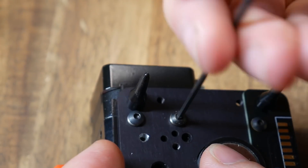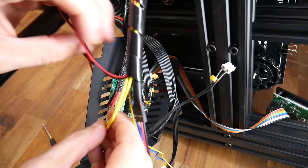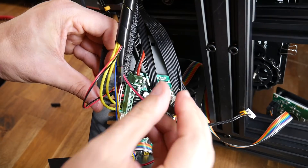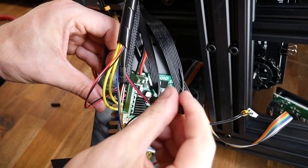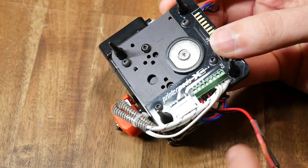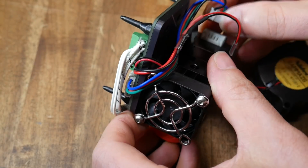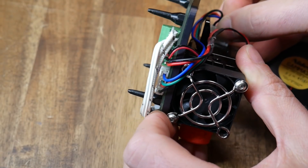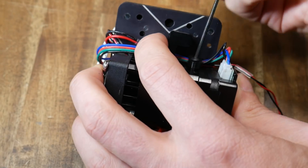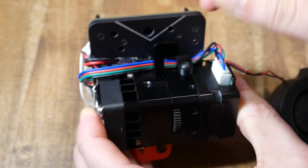Two short M3 bolts and the H2 will be securely attached to the tool plate. For wiring, in a standard installation you'd run all the wires from the kit back to the main board. With the XChange however, I only need to run wiring to the terminals on the back of the tool plate — this includes the heater, thermistor, and fans, as well as a small cable to connect the stepper motor. To help tidy up the wiring, I designed a very simple small clip that goes on top of the H2 and holds the extruder stepper motor and fan cabling out of the way for easy operation of the lever.